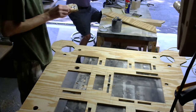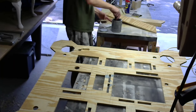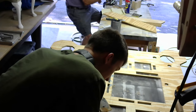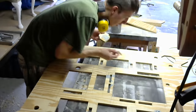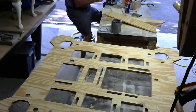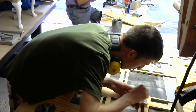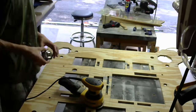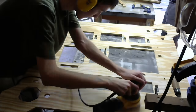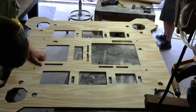After I finished the cutting of the frame, there were some imperfections and some small mistakes that needed to be fixed before painting and applying the wrap. This was done by adding a quick setting filler to the imperfections. This stuff dries fast. You only have about 2 minutes of working time before it sets, which is perfect because I hate waiting for stuff to dry. Once the filler was set, I sanded down the entire frame with a circulating sander to get rid of the little wood fibers and rough edges.